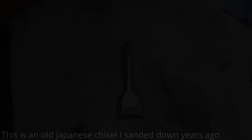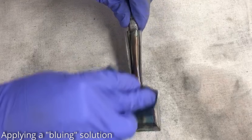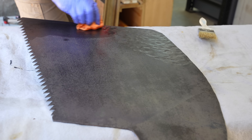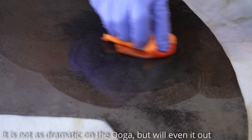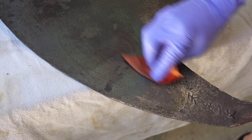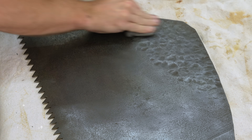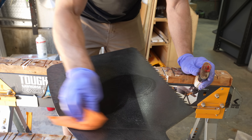There was an additional step I wanted to take to get the steel looking exactly the way I had envisioned. This is called cold bluing — an oxidation process that really helps prevent rust, but for me the reason I really wanted to use it is it gives a really cool deep bluish-black, natural, hand-forged look. The steps aren't very difficult: get it really clean, wipe it on, rinse it off with cold water, come back with steel wool to buff off that surface rust, then apply a little three-in-one type oil to lock it in for about 24 hours.